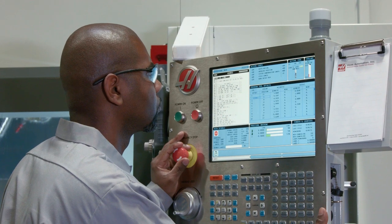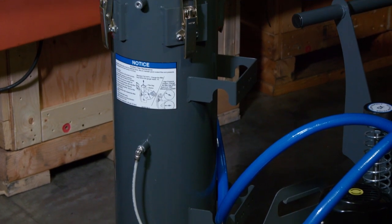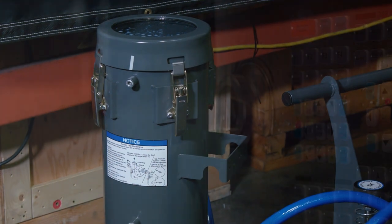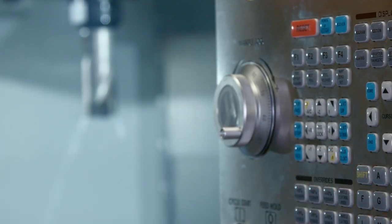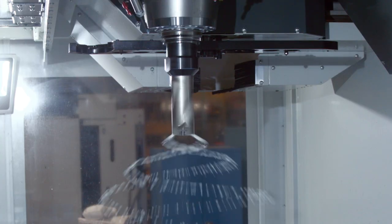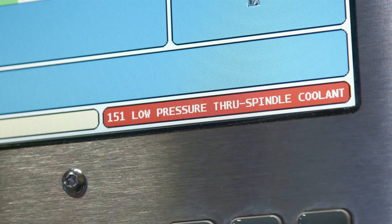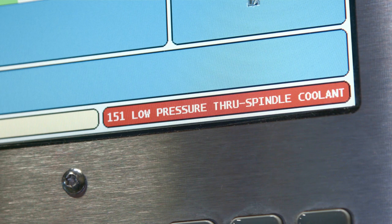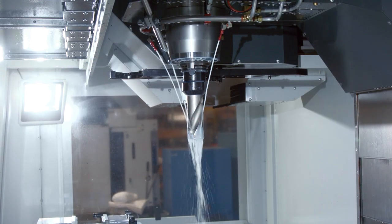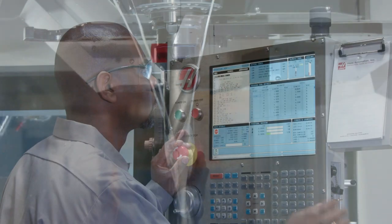To start, Orville checks if there's an issue with the coolant pressure. Since the ACF unit is most commonly used on TSC systems, let's see how that system behaves when there's a clogged ACF filter. Orville activates TSC with the spindle turning slowly. After a short period, the system faults out and we see alarm 151 is generated: low pressure through spindle coolant. If you have the ACF connected to your standard coolant pump, you'll typically see reduced coolant flow at the nozzles when the filter becomes blocked up.